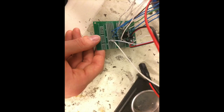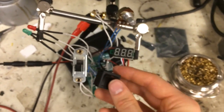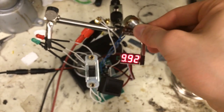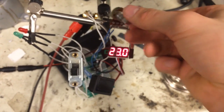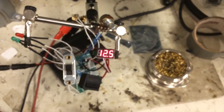After soldering the circuit together, we can do some testing — hopefully it'll perform exactly the same way as it did on the breadboard. In the 24V range, we have the full range from 1.3V to 23V. And when we switch to the 12V range, the maximum is about 12V.